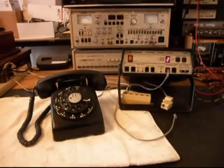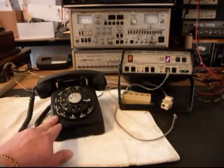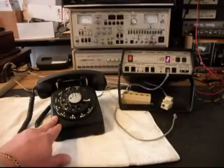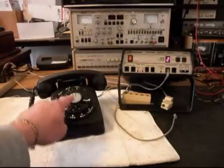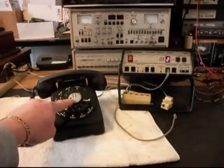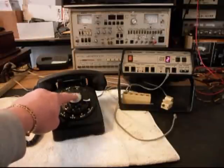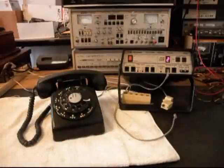Today I want to show you a really cool rotary desk telephone. This is Trisha's telephone from VA, and this is a Western Electric 5302. Basically what it is is a 500 set, but they were still using 302 parts in this telephone, so it's called a 5302. It has the metal finger wheel, still has the metal center ring dial, and what we want to do is get Trisha a center dial card that fits the period of this telephone.